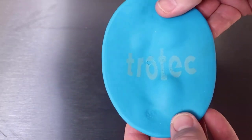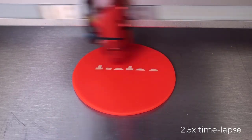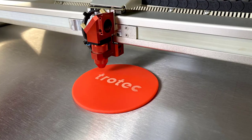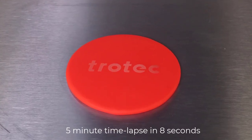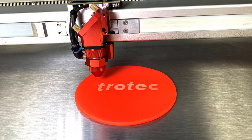Let's now try the color red to see how the different color reacts. Red seems to react the same way as the blue, but this time I will put a time-lapse camera on the finished engraving so that we can see how it holds up. The red is producing a very high contrast, but like the blue, the engraving is fading away after it is complete. You can see here in this time-lapse of five minutes compressed to eight seconds, the engraving virtually disappears, especially if you compare it with the photo taken shortly after the engraving was complete.